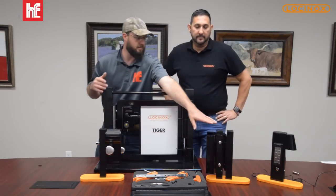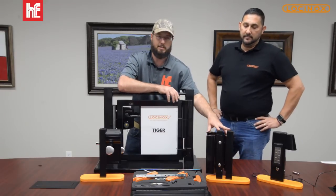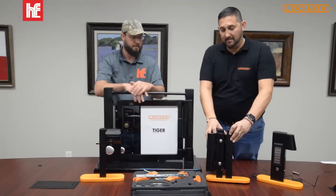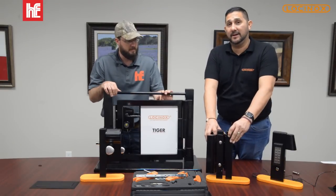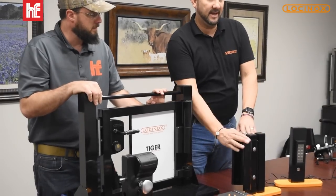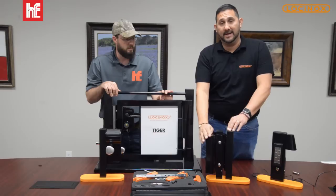Right on. Okay, then we come over to a very popular style of locking gates, and that's going to be the Maglock. What is the name of this product? This is the Maglock. This is the Mag 2500. It has 600 pounds of holding force. There's another one we sell that has 1200 pounds of holding force. You can get it with the handles or without the handles. If you're mounting the Maglock at the top of your gate, you want to get it without the handles.